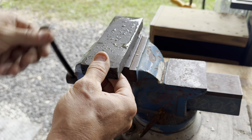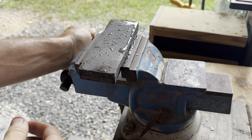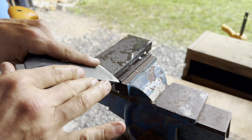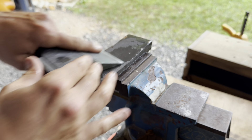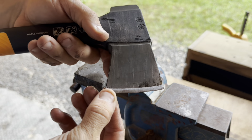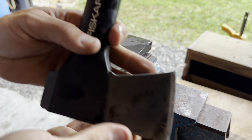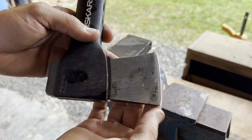Probably my favorite way to sharpen a tool is with just a whetstone like this one. I'll lock it in my vice. A lot of people like to do just push strokes, but I like small circles — that seems to work best for me. I'll work that blade along the surface of the stone in small circles, stopping periodically and checking the edge to see where I'm getting it the way I want. And you can sharpen completely without a power tool or even a file — just a stone. It just takes a little more elbow grease.